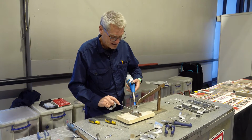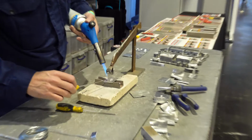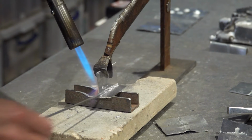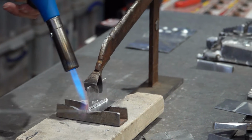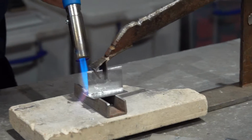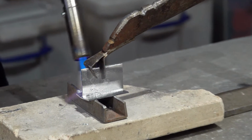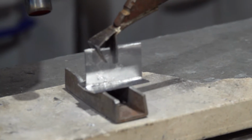So you can see here, take a drop of it, using a regular screwdriver, dragging it out, and at the same time cleaning away the oxide layer. And now the welding wire starts to fuse as it's creating a new alloy for you. In a few moments you will see on this side here small shimmerings, and when you see the shimmerings it tells you that the weld has gone through. You see that? That's good, and that's the weld trespassing through the material. That's all what you need.